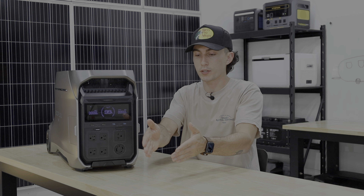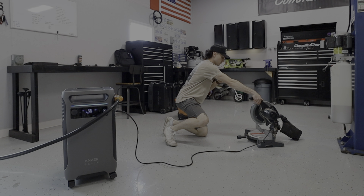I also don't like that this unit can't do 240 and 120 at the same time. It's not a massive deal, but for example if you have this running off a transfer switch in your house powering everything via the 240 plug, you can't walk up to the unit and physically plug something into the 120 outlets. The technology to do both simultaneously has been out since early this year at least.